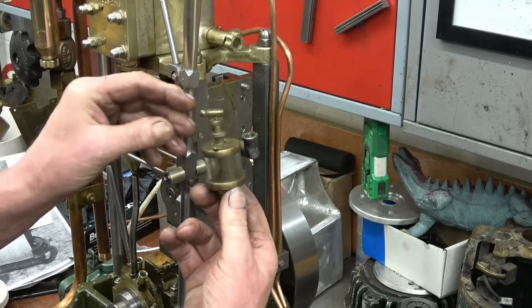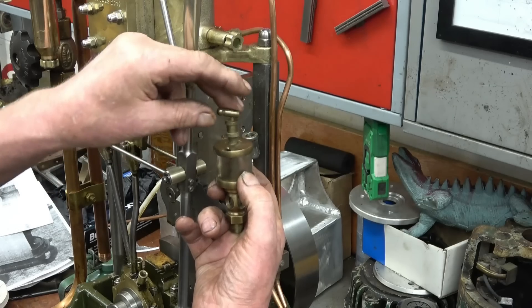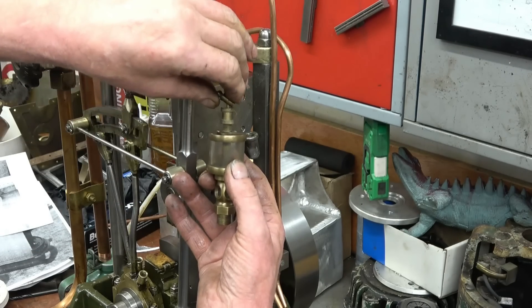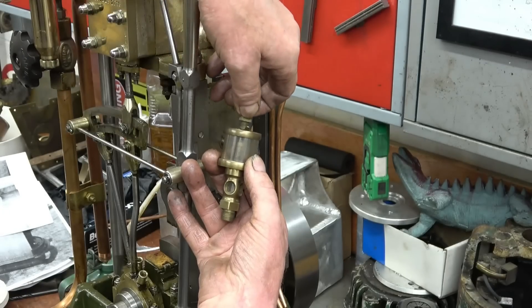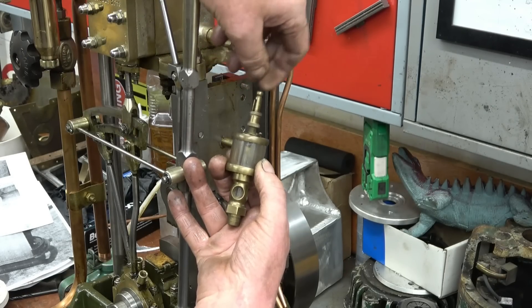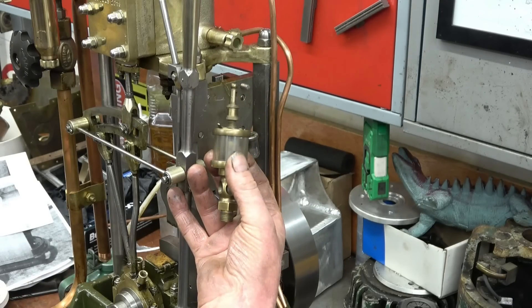It's clever how they work. You fill it with oil — there's a little port there, you put oil in. The way it is, the valve's closed — there's a little spring with a needle valve that's closed. All you do is lift the valve up and the oil drips, and you can see it dripping through that glass there. Depending on how high you have that screwed up depends how much or how little oil drips through. Really simple but effective.